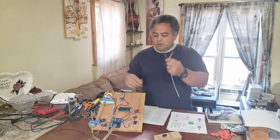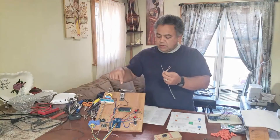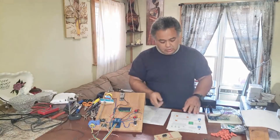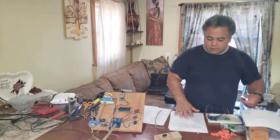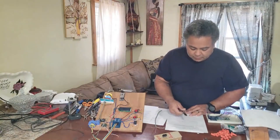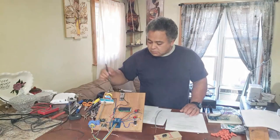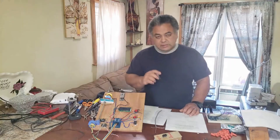You'll want to assign a color for each limit switch. There are four pairs inside the network cable and four limit switches, so assign one color per switch and take note on the wiring sheet what colors you've assigned. When wiring it up: the backup switches use the normally closed terminals, while the first floor switch and the second floor switch use the normally open terminals. That's the only difference.